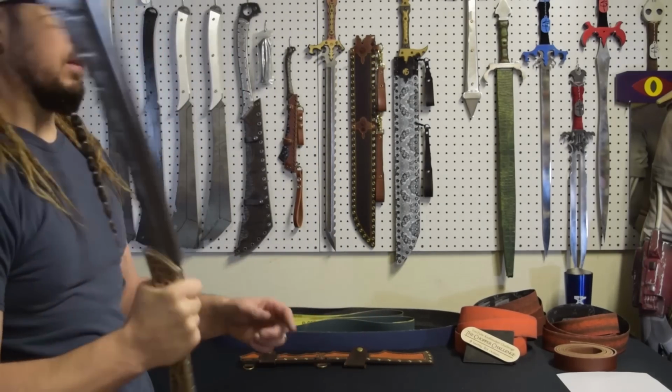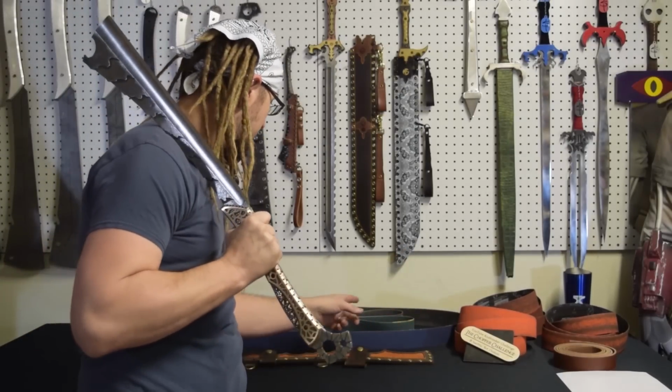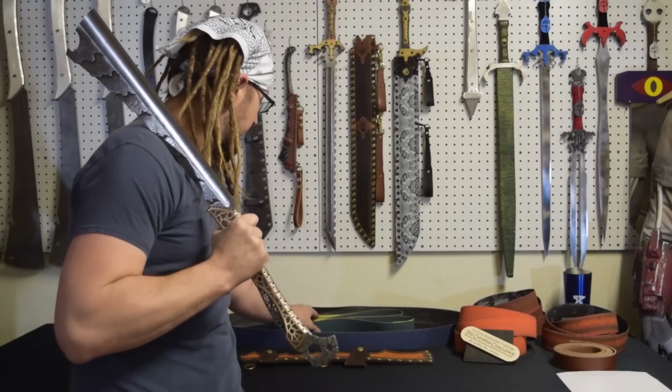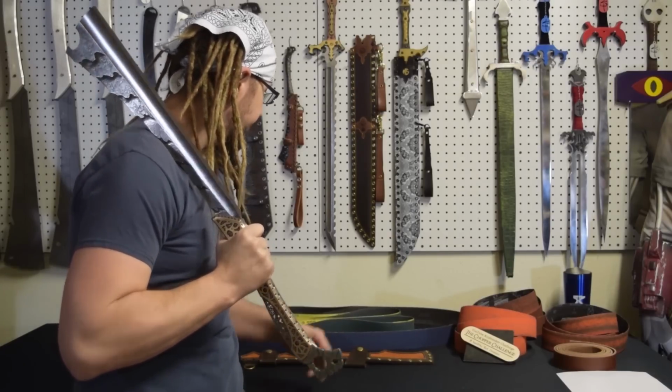I know in the voiceover I wasn't sure as far as the edge bevel belts. After those 50 grit, I went to a Norton, it looks like Blue Fire, and then after that was the J-Flex 220 and then 400.